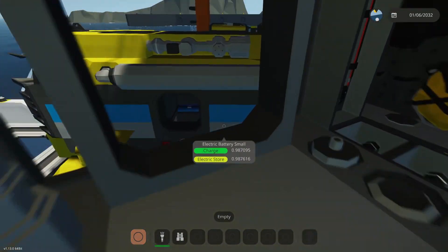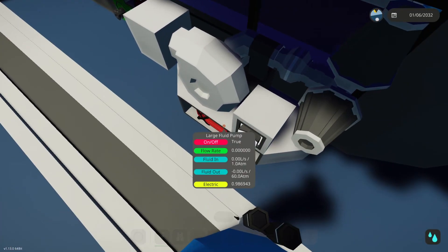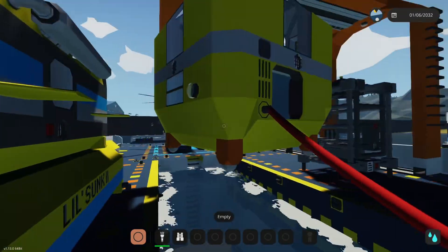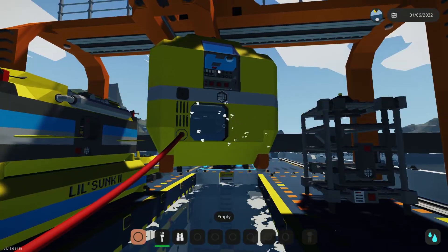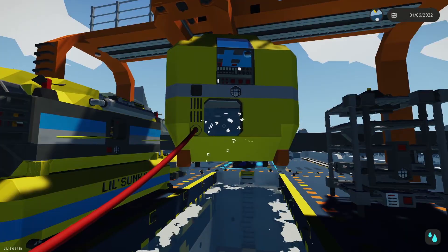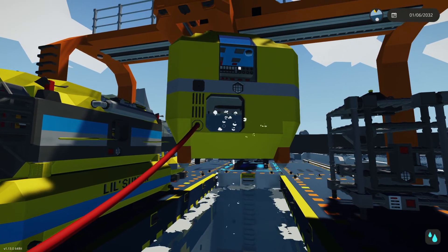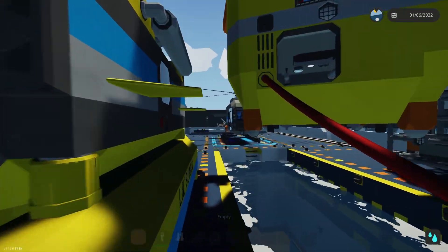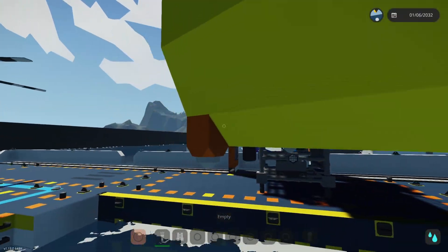It doesn't drain super quickly, so if you have something like this that's full of water, you can go to your air pump, grab the hose, attach it to that nozzle there — and it's labeled 'drain water / drain pump air in'. Once you're pumping air in, you'll see the water level start to drop. You have to push air pressure in to get the water to drain. If you wait long enough it will fully drain itself, then detach the hose and your diving bell is ready to stow away.